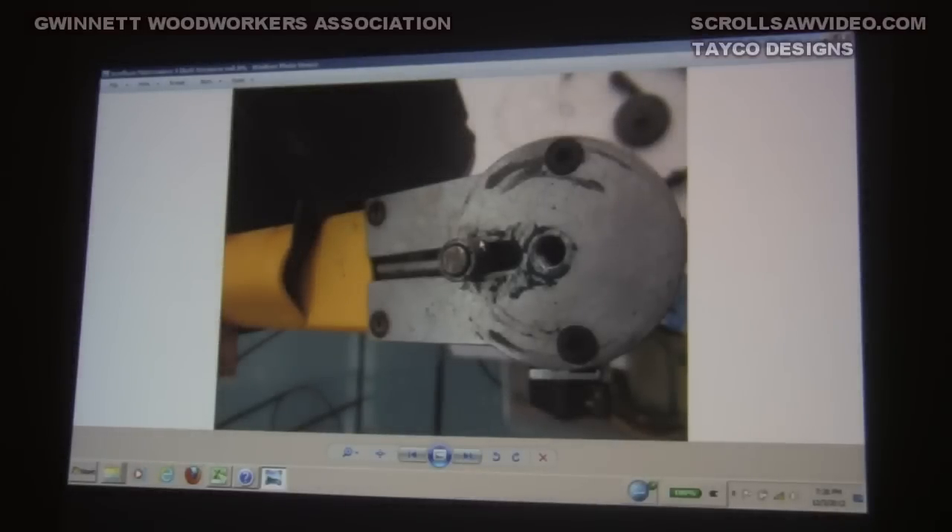This is the top plate. Most of you are familiar with the tensioner on your scroll saw — George usually racks his over to about an eight or nine, while those of us more faint of heart stop at about a five to get the right blade tension. This is what's underneath that tensioner. About half the saws I've taken apart, people have serviced them and frequently forget one particular linkage part that's there, lose it, and try to compensate by adjusting the rod — so the tension never completely stays. If you go diving into one of these, you need to remember that part is there and put it back.